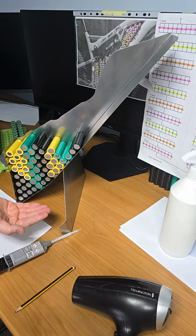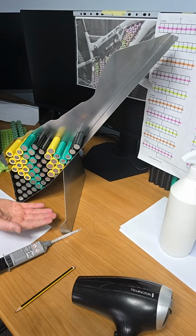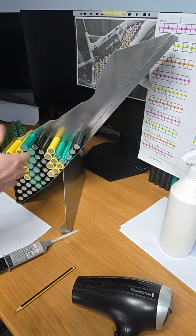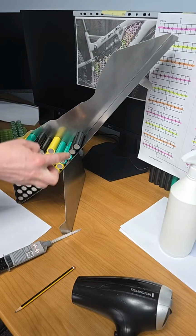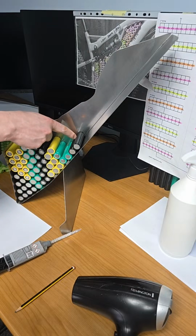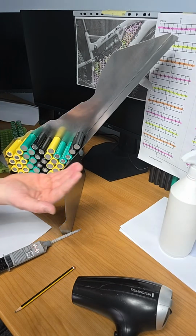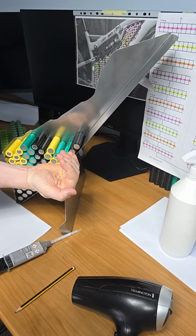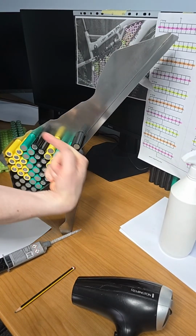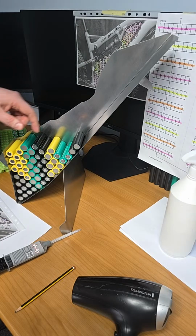So when I'm building these cells within this pack, in this capsule, I'm trying to keep them level, so there's no misalignment between the cells. Because if you imagine now, if I glue here, look, and this glue tends to cure, more likely once the glue contracts, the cell might want to come this way, this direction, because I've only glued this side. If you imagine it drying out, so hopefully that makes sense.